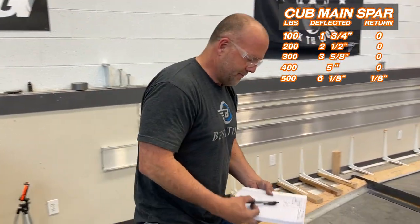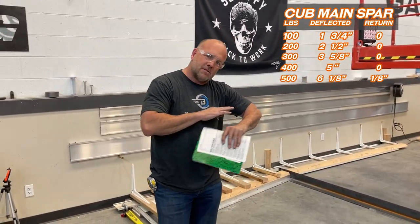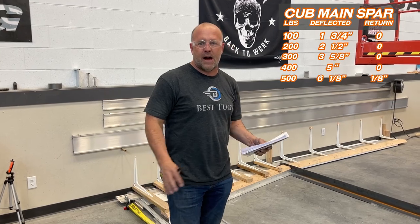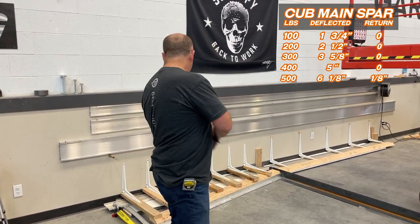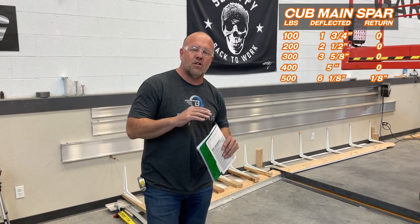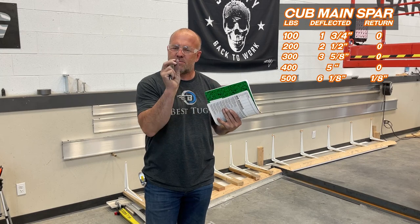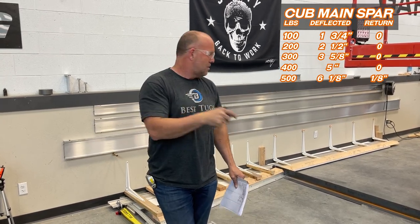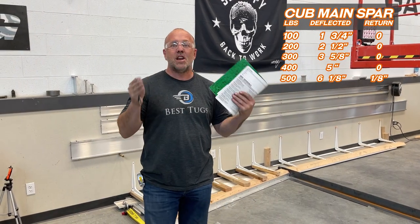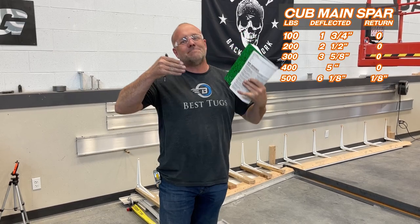Let's pull some more. This is definitely at a point where if it did bend in just absolute severe turbulence, you're overloaded in your Cub and you bent it, you wouldn't even know it. There could be Cubs flying all over the place like this. There is no structural real integrity damage yet, just moving that much. I mean, about an eighth of an inch over that distance is minimal. And if you let this sit for a couple days, it might relax back into state.